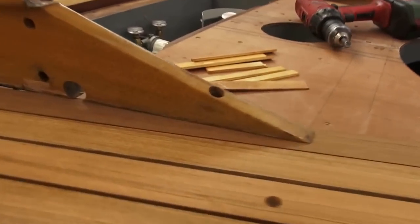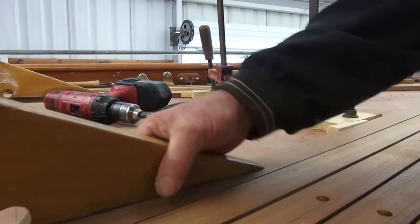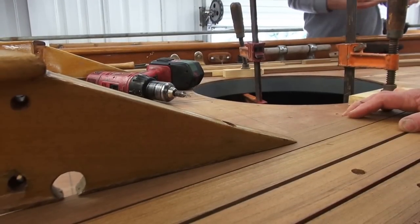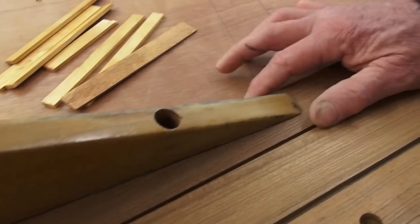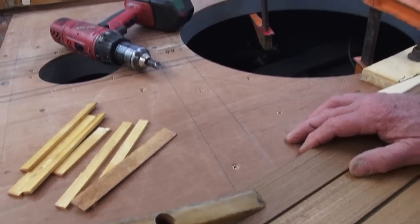Okay. What do you mean? Perfectly. Thank you. Yeah. Came out awesome. And this is going to be a bolt, of course. So if there's any discrepancies, it's going to get caulked and bolted down. Now, for that reason, this one was tricky a little bit. You have to drill it out. You're going to have to drill that hole all the way through at the perfect spot. Yeah, we'll just drill from up here. See, we added some blocks under here. They didn't have it before. So we put a 1-inch block on both sides to take this bolt. Oh, beautiful. So when we go to actually install that, it'll have like that much, like 2 inches of timber.